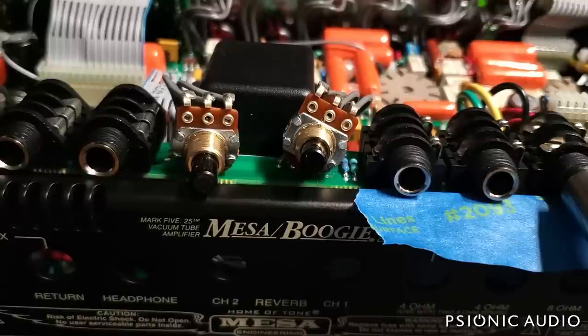So I expect when I put this back in its combo cabinet with its tank that I will be hearing reverb. I hope so, because I have to put the whole thing together in order to put it in there and do the test, because the tank that it uses is not the same Fender style tank that most amps use that I have for test purposes. So the reverb was never the complaint, so hopefully that's fine. So I just got to find my bag of J174s, swap that out, and button it up. And confirm everything is working.